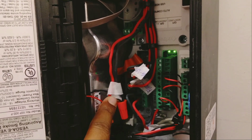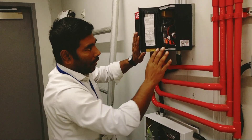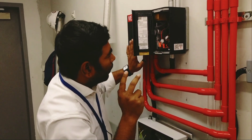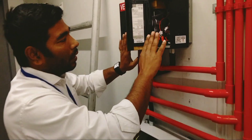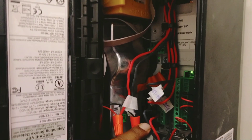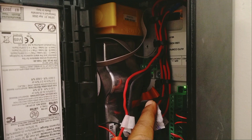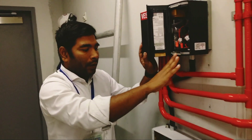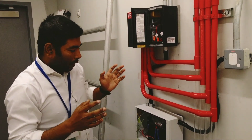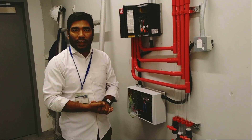So all are connected together with the fire alarm interface cable. If anything happens — panel failure or battery failure — the fire alarm panel gets a trouble signal. We have three signals for the fire alarm: Fire 1, Fire 2, and Trouble, plus the alert system. Fire 2 is connected common and normally open, Fire 1 is connected common and normally open, and Alert is connected common and normally open. If you have any questions, comment below this video and I will reply. Please share with friends working in fire suppression systems and subscribe to my channel. Thank you for watching.